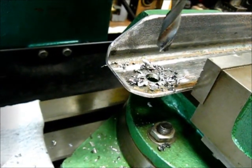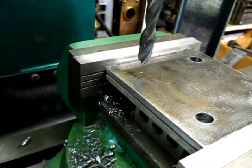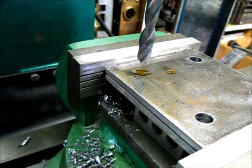Now the quarter-inch thick plates — I did stack them together for drilling through. Half-inch, got that marked out there, got the table locked in both axes. Let's drill this last hole in these two plates.